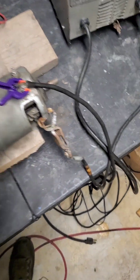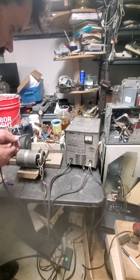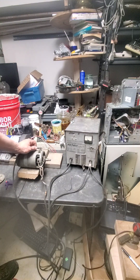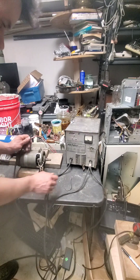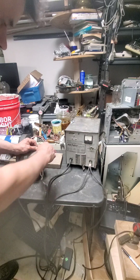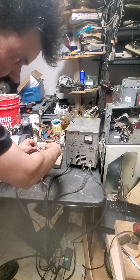We're going to run it with this 12-volt power supply. When I add 12 volts with the case grounded, the motor starts turning over a little bit — it's not very fast and I can stop it pretty easily. But if I add 12 volts and then start bumping the fields to charge them up like a magnet, this motor will run at about 10 amps.